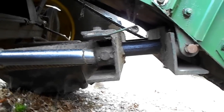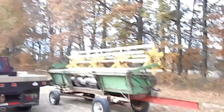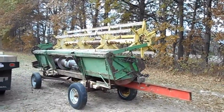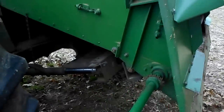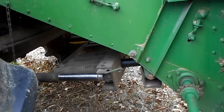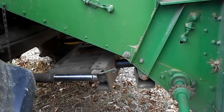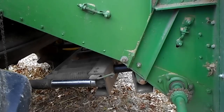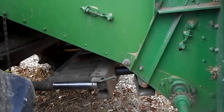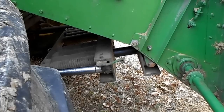What that'll do is allow that head to float up and down independently. With the floating cutter bar on that particular head, if you set those springs right, it's like an automatic header control — it'll go up and down about a foot, which is a great help. You can set it and go. You still got to keep your eye on it, but it's not like running a straight head to keep it out of the dirt.